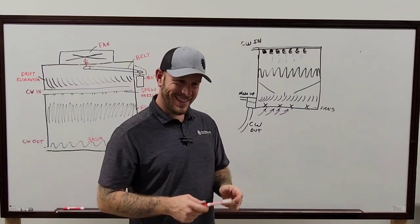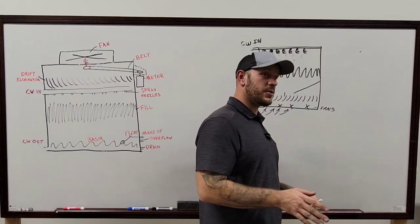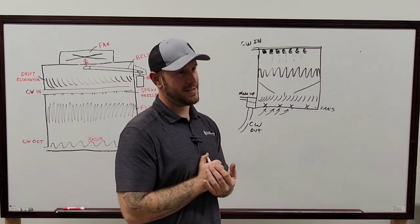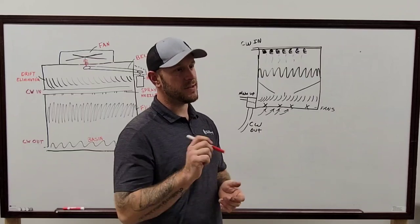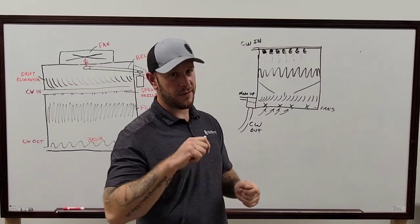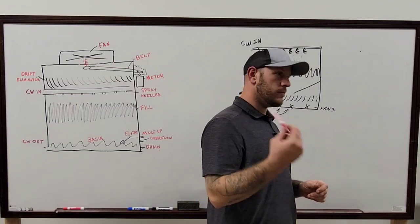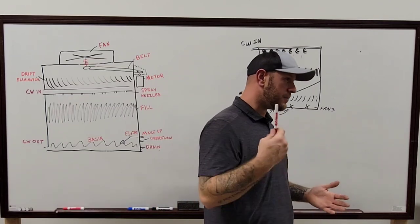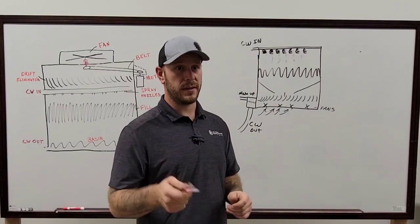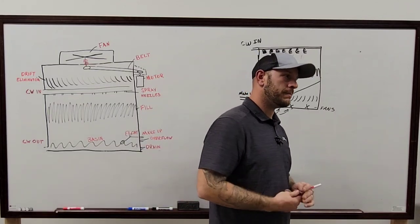So I'm letting you know now. And just so everyone knows, in the little box that it comes with, the instructions tell you that specifically. So we can check it. Yes. There's a reason why there's a spot where it says you can hit it right here to punch into place. It's because it locks onto the shaft and then it tightens down. And you do it with the rotation of the shaft. Because if you go the opposite way, whenever it hits vibrations or certain frequencies and it does all that rattling, eventually it backs itself off. And then that's when you have to worry about that key stock eating into the shaft of that motor and all that kind of stuff. It's bad. I've done it.